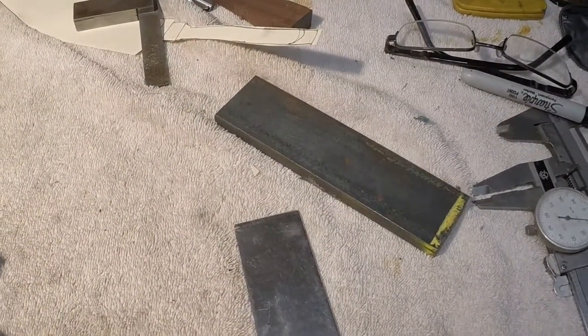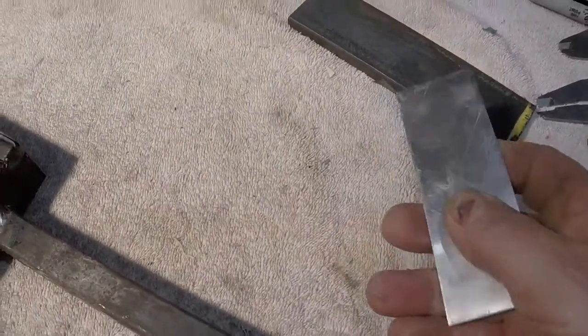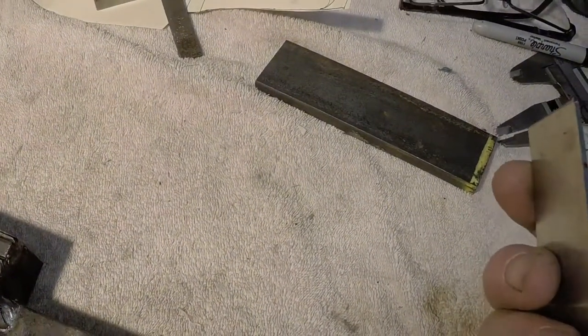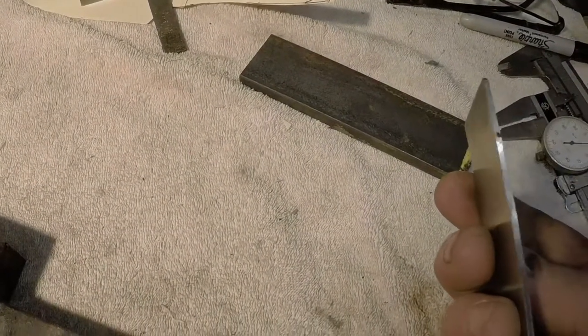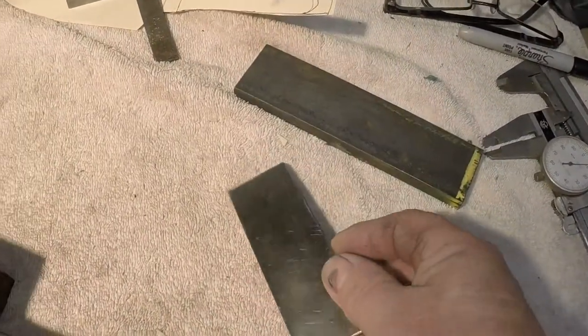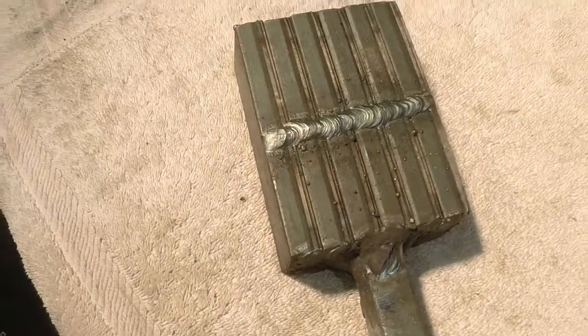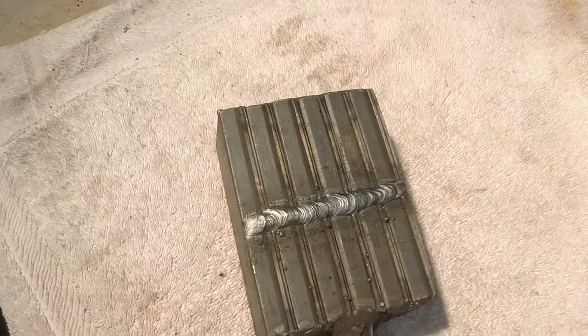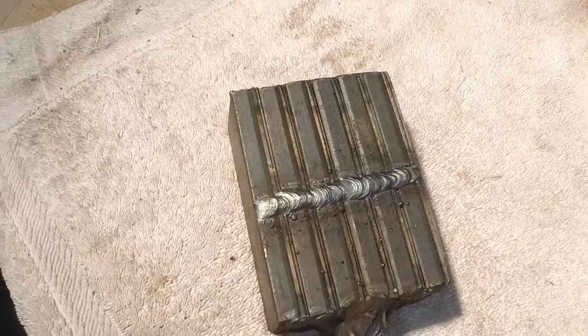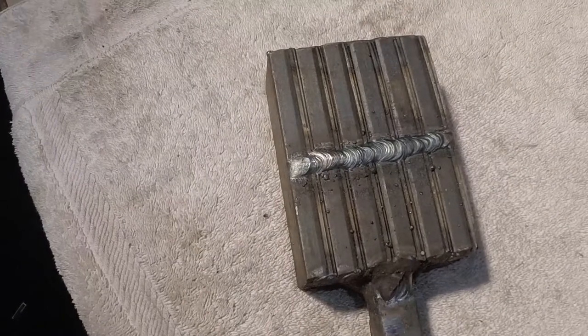And here are these pieces of steel individually that are in this. It's called a billet. This piece of steel here is about an eighth of an inch thick, and this one is about 3/8 of an inch thick, and they're stacked up into a stack of repeating layers, a little bit of one, a little bit of the other, so that there's six layers each.